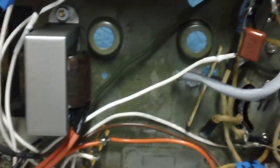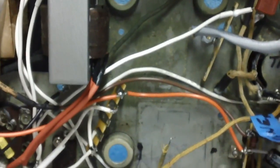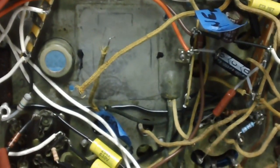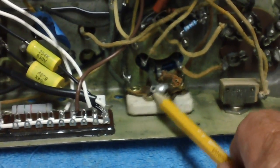And also, I decided I'm going to go ahead and take these loose and twist them around one another and run them up behind the choke wires in here closer to the chassis. So all that little cosmetic work will be done for the next video. So let me see. I don't think there's anything else I need to cover. I'm also going to get some screws and fasten this baby back to the chassis, get some brass screws. I got some, but they're not quite long enough. We'll put that back here.